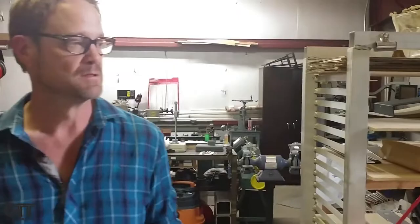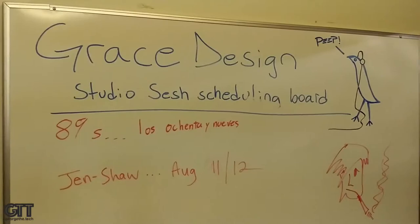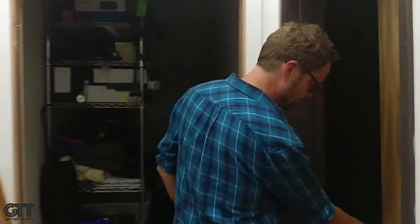We've got a little studio back here. It's mostly a listening room — good for mixing, editing, and smaller recording productions. We built this out when we bought the building; a friend of ours designed it. We cut the slab of the building so there's a two-inch gap in the slab all around this room. It's all double wall, tons of drywall, and we've got a floating ceiling.